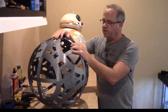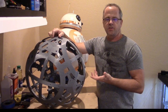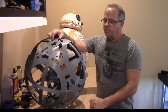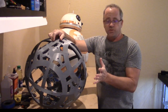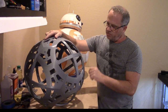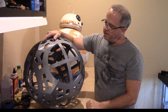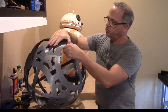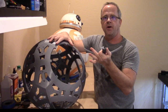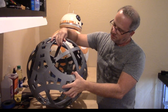One of the things I wanted is lots of access into the inside of the sphere, because we're putting drivetrains in there. Drivetrains mean large parts that you need to get into the sphere to make it work. I didn't want to have to completely disassemble it. Going back to the ribs - I also didn't want to spend a lot of time taking the ribs in and out, and I wanted something where you could go to 45-degree angles. The ribs can be rotated to any one of these tabs. The cool thing is the ribs themselves, even though they have screws, are actually not screwed in. The way this works is a pressure fit in place - they simply pop right out. They slide into these slots into the middle, and you can take the rib and go from here to here really easily.